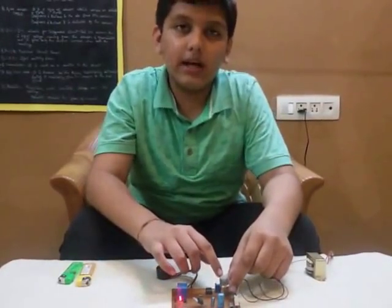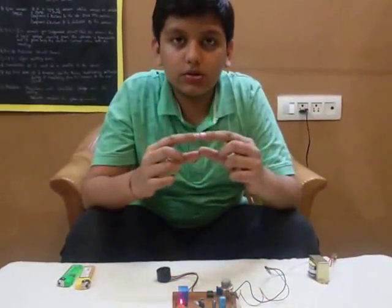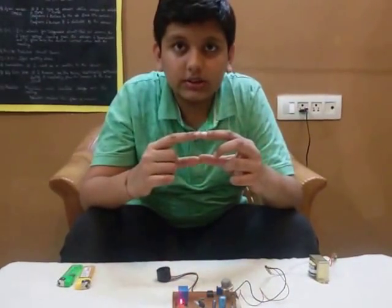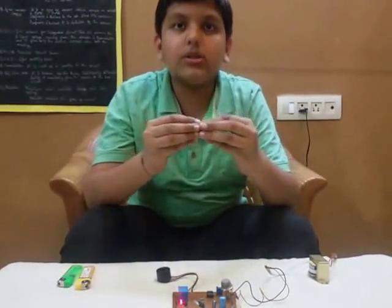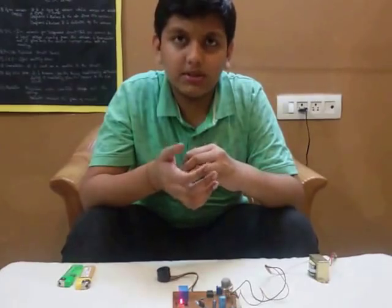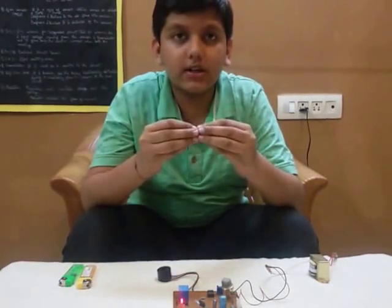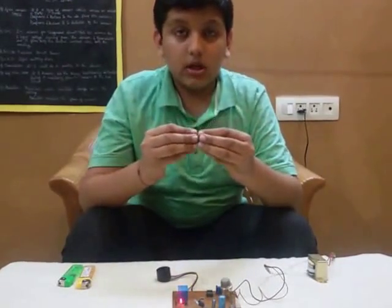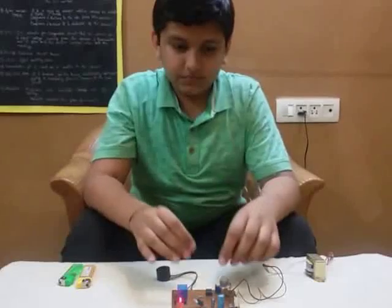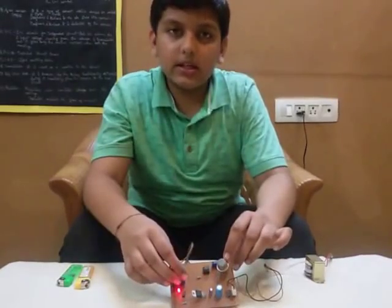This is the gas sensor. There are two electrodes in the sensor. Between them are oxygen and nitrogen molecules and a bit of radioactive material, mostly americium. This radioacts itself and the molecules of radioactive material clash with the oxygen and nitrogen molecules to generate electricity. So electricity is flowing inside this sensor at all times.